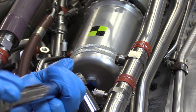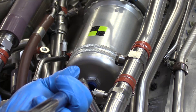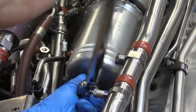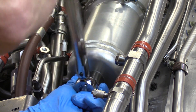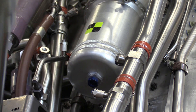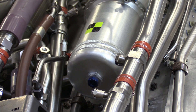I have set the torque wrench just below the maximum run-on torque as per the aircraft maintenance manual. We can use that to complete the installation of the filter bowl. The filter bowl is completely seated. The torque wrench did not click, so I know I have not exceeded the maximum run-on torque per the AMM.